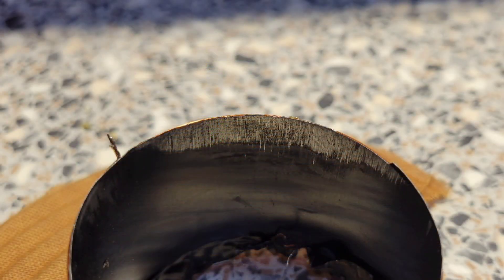I was not surprised to see this, basically because when I first got the speakers, this woofer did have some coil rub. Somebody had re-foamed them and hadn't got the voice coil perfectly straight, and it was quite obviously rubbing really bad right here.